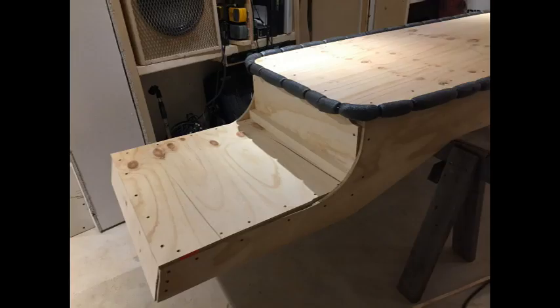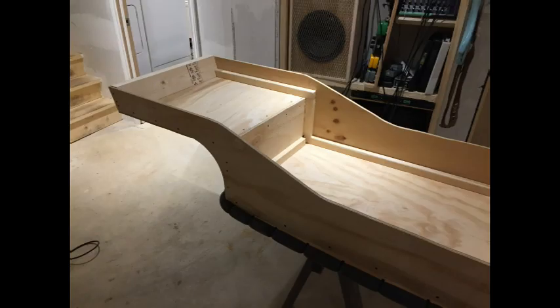You can see I made a bit of a mistake when I attached my sides — I should have included some offsets from the bottom to the side frames, specifically where the overhanging transom piece is. If I had done a better job of that, I would have required less epoxy and filler later on. But at the end of the day, it's fine — just a little more work. What you want is a nice, rounded, smooth corner pretty much everywhere.